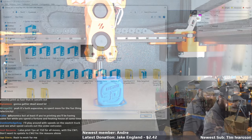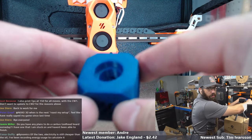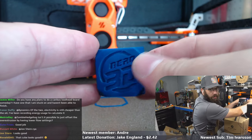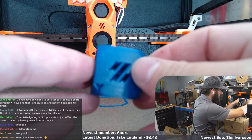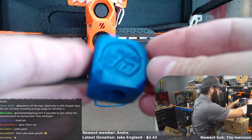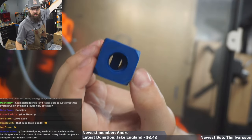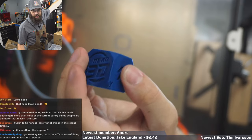Okay, so let's take a look here and see what we got. Actually, that focus is pretty good. There's our top. There's our front. Direct overhead lighting is evil. There's our one side. So you can see where speed changes, because the width changes, you get these little artifacts, same like on the Benchy. There's that side. And that side. And there's your bottom. So again, this is a profile that's tuned for ABS with a max fan. With filament I've never used before! On a hot end I've never used before!